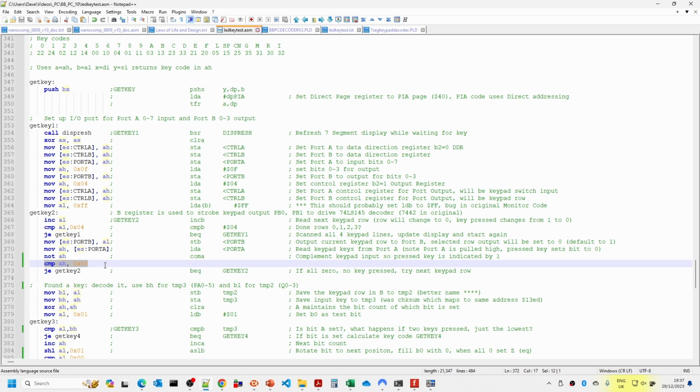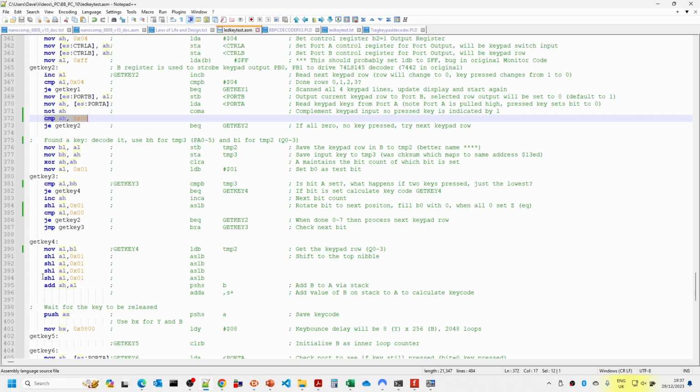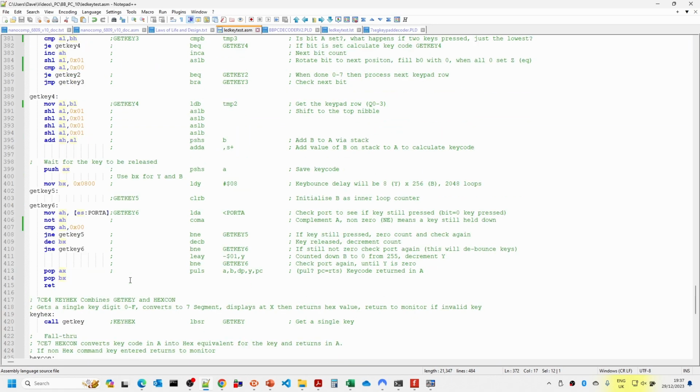So there are some differences in the way the two processors work, quite understandably, and getting to grips with that just took a little bit of time to work out what was going on. Now I know that some of the shift instructions in the 8088, 8086 make it possible to provide the CL register to supply a value, but for the moment I've just kept things simple and am trying to match across to the existing 6809 code.